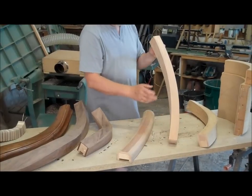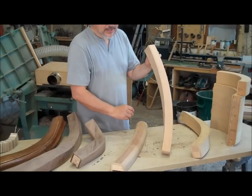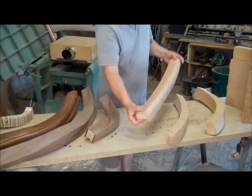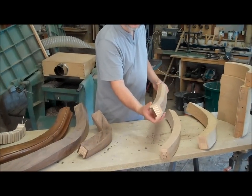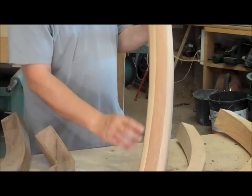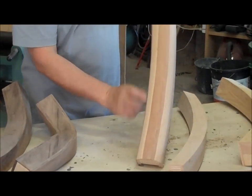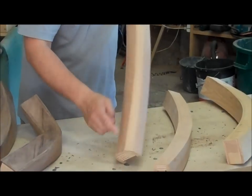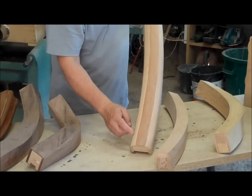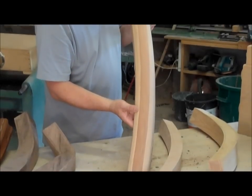This doesn't require taking the shape off the metallic handrail — you can just mark it out from a plan and it usually fits quite well. Here's another example of twisted laminates which have been rounded off at the top. It can be rounded off using moulds; you just have to give enough layers on the outer laminates to be able to mould it. This one has a decorative effect where the type of wood in the laminates has been changed, giving a decorative effect of different coloured woods.